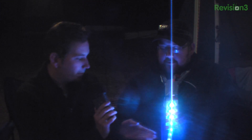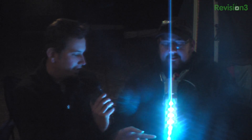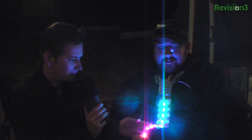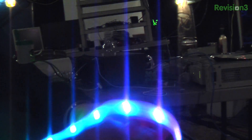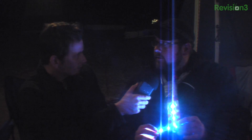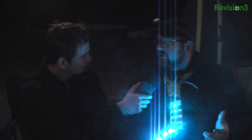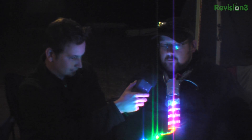So tell me, what is the unique thing about these LEDs? These are surface mount RGB LEDs that can change to multiple colors. You've got this flexible thing in a polyurethane case. They're semi-waterproof — water resistant is probably what the marketing people or lawyers would want to say. They have an LPD8806 between each two LEDs. They're actually severable, so you can cut them in chunks of as short as two LEDs and make whatever pattern you want, whatever length. They're individually addressable, so you can have them become a pixel display.